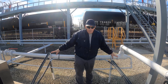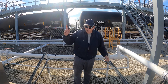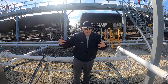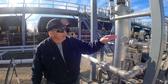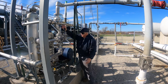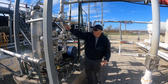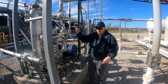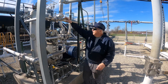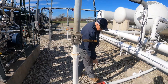This line here is where vapor connects to my scavenger tank, enabling the scavenger tank to be looped into my system. On the outlet side of the compressors, when I'm pulling vapor out of the rail cars in recovery, I can open one valve in the scavenger tank and pull the vapor down on it the same as I do the rail cars. Then when I switch into recovery mode, I close this valve, change the four-way valve position, and engage my bypass so the compressor circulates without pushing or pulling.